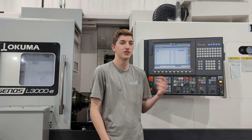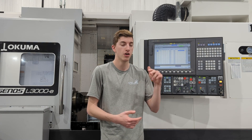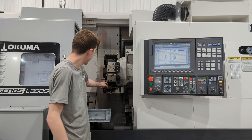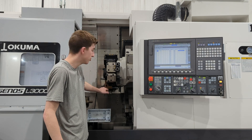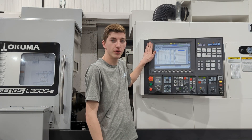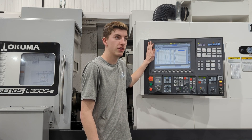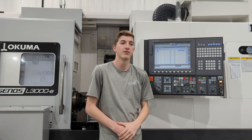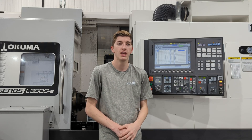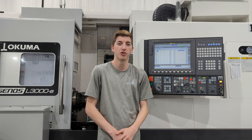My version of the tool counter allows you to count for any tool without a spare, or count for multiple tools on the same pocket — say if you have a dual head or a drill head with a drill going out either direction. The way I accomplish this is I use the already built-in management counter and the variables that come along with it. I built a subprogram that you can put anywhere in your code, and when it calls that, it will increment the correct values.